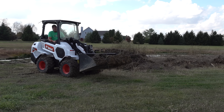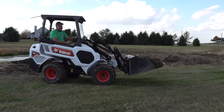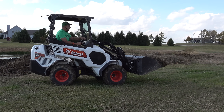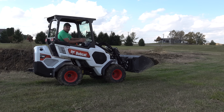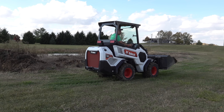I had some large equipment operators mention in one of our other videos, when we were working on this hard clay, about how you just need to run your bucket in and then curl it — that'll break it out. That's true when you're using real heavy equipment, but these lighter machines just don't have enough curl strength to pop that loose like that. I was doing the best I can.